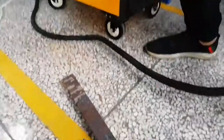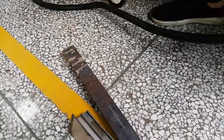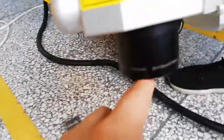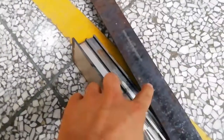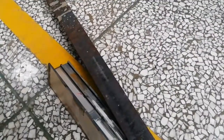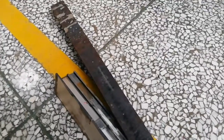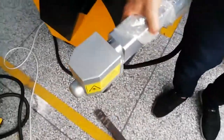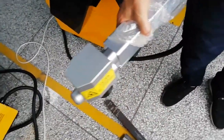The focus lens distance is around 254 millimeters — that means the distance from the edge of the lens to the cleaning material should be 254 mm. Actually, it should be around 300 mm; different machines will have different focus lengths, so you need to check which is correct for your machine.